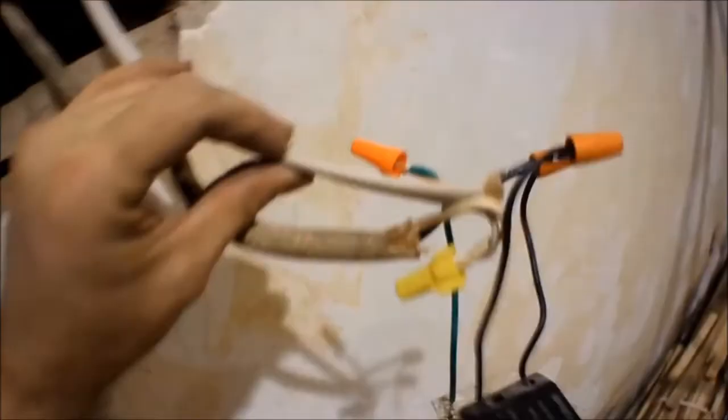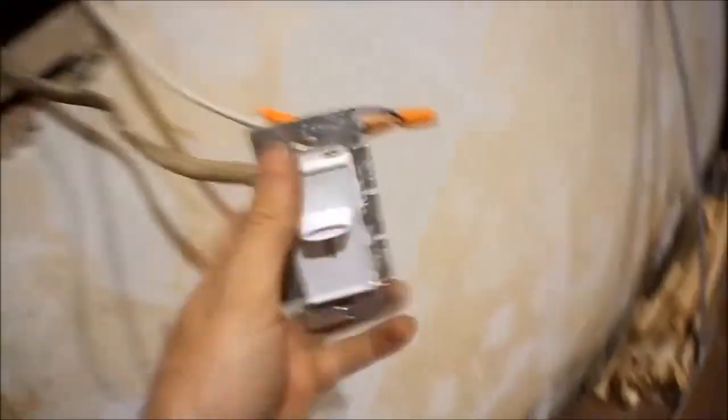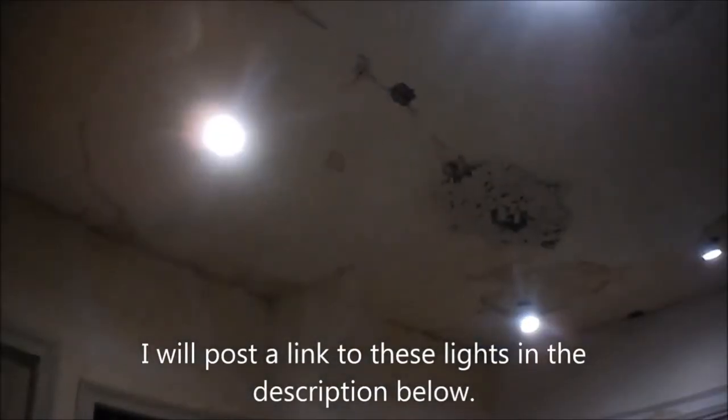I got the new wire ran from this light, in here and down here. It's pretty simple — you just plug in the whites (common), and then you got your black wire that runs to your switch, and the other black wire runs to the wire coming from up there. This one's a dimmer switch — they're all on 5000K brightness. That's it dimmed. That's it off. There's no twitching — some cheap LEDs you can buy on eBay twitch. These have no static, no twitching, no noise. This is just a Lutron dimmer, nothing fancy, probably paid 20 bucks for it. Works perfectly.